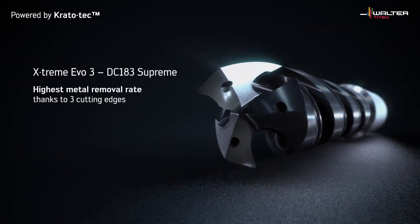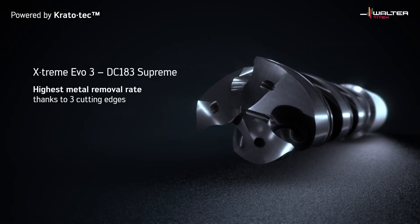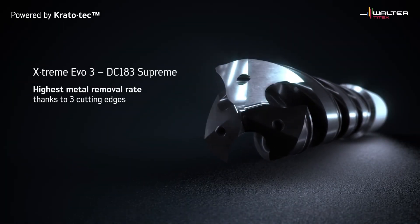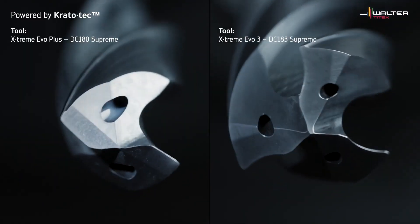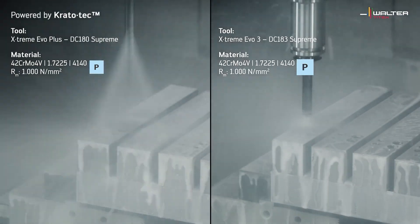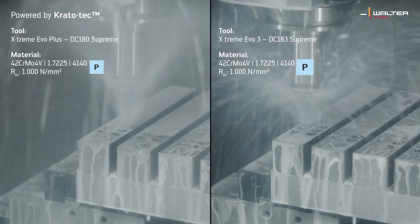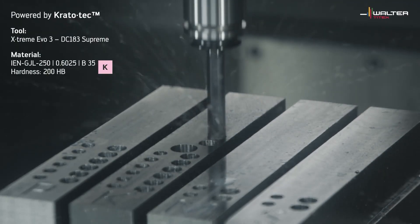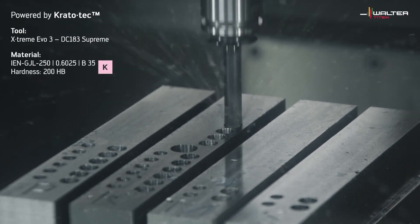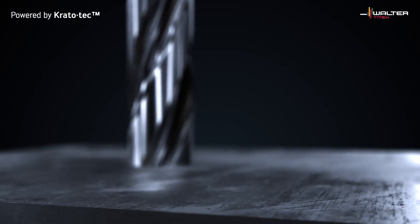So obviously this is the two-flute, and you've got the three-flute. Why would I pick a three-flute over a two-flute drill? There's no straightforward answer for that one Tom — it's application specific. If you want increased productivity, then the three-flute drill can give you a 50% increase in feed, which reduces cycle times and is great for production runs. But whether a three-flute is suitable or not is down to the application.